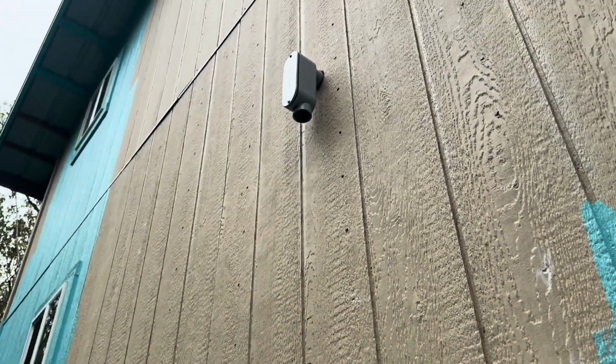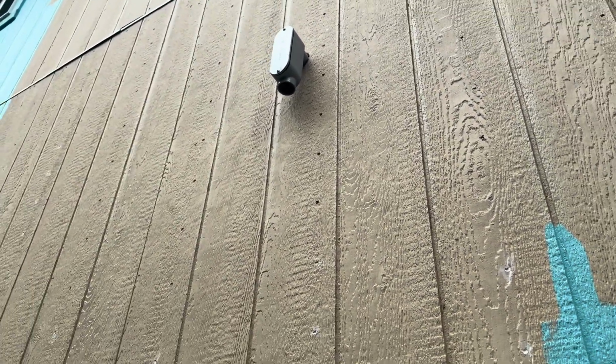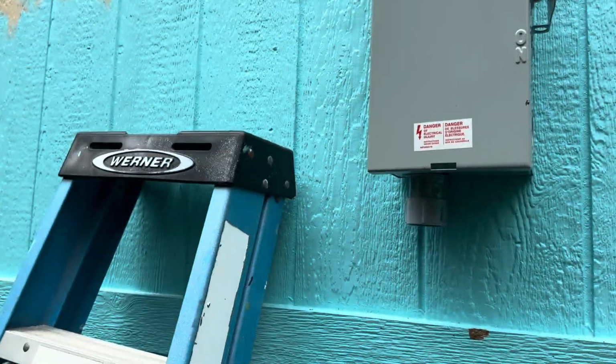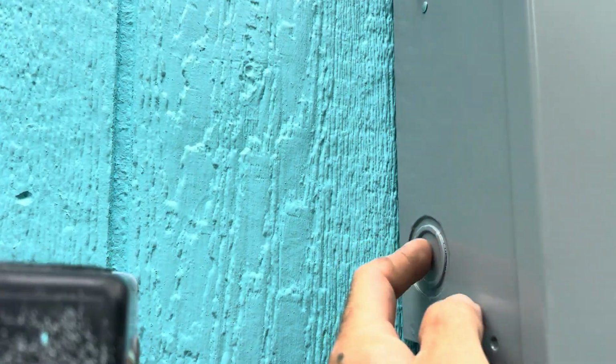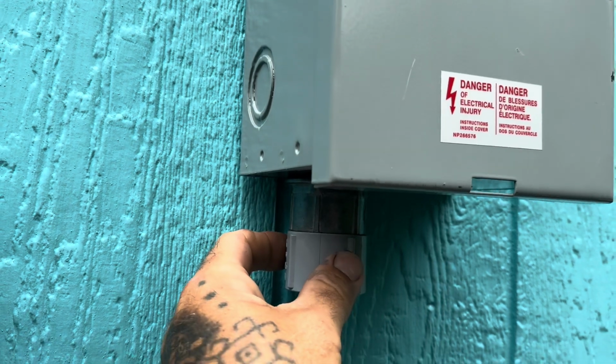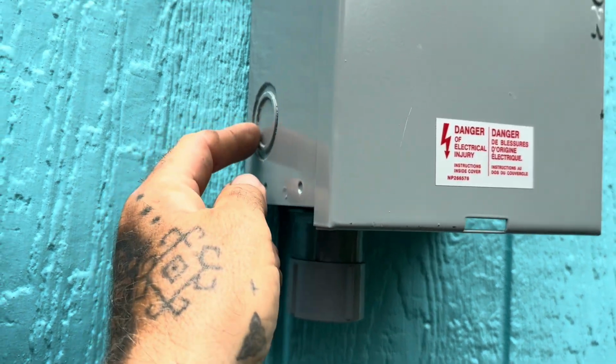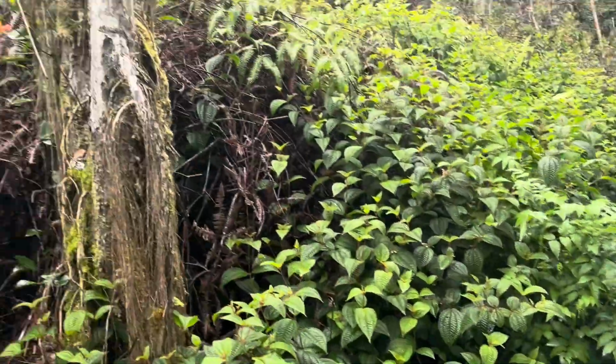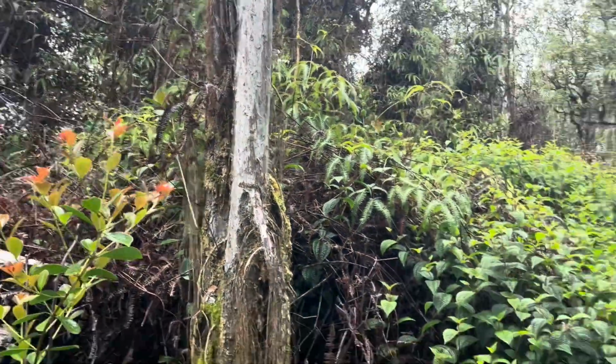Basically, that's where it comes out of the top of the breaker panel. So it'll run straight down here, and it'll 90 into the box here. So I'll get another one of those connectors, and it'll go here. And then from here we'll go down, and then to the house. So in the morning I'm going to run to Home Depot so I can get the glue, keep going.